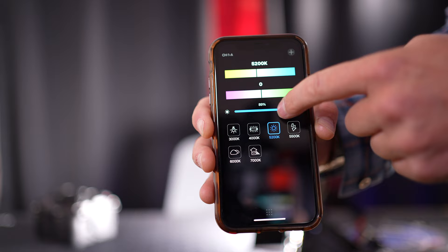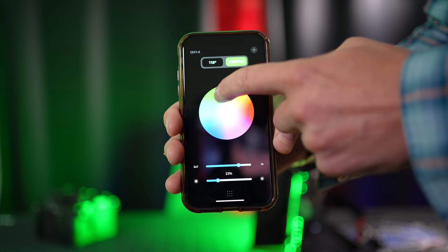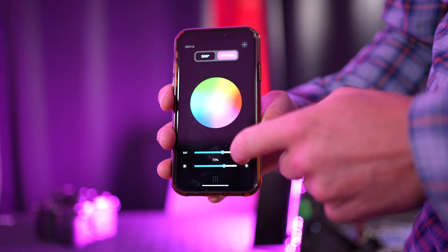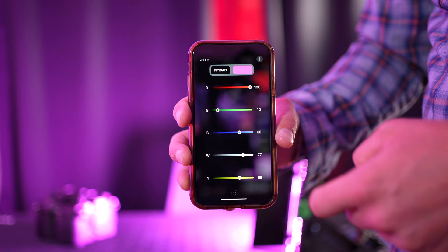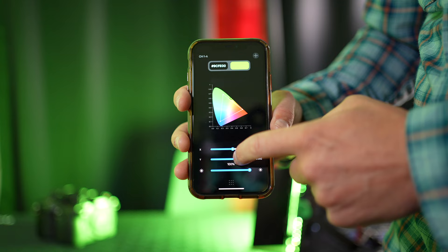HSL mode is an RGB mode that allows you to easily pick a color by tapping or dragging your finger on screen. I noticed this took a moment to kick in after changing the modes to respond, but once it changed for the first time, it was fast and responsive to any other color changes I made. You can change this mode's saturation and overall brightness by using the two sliders on the bottom or the dials on the back of the light. RGBYW allows for more critical color selections by letting you blend white back into it. If you want a really saturated color, then just use the standard RGB mode. RGBYW mode is so much easier to control on the smartphone than the back panel, so definitely download the app. XY coordinates is another color selection mode that could be used either by tapping anywhere on the XY axis or by using the sliders for more precise control. To my mind, this is exactly the same as RGB mode, just a different way of operation.